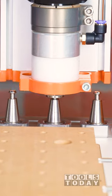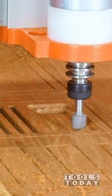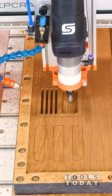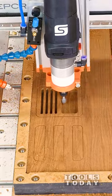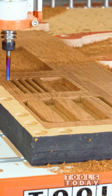We'll use the automatic tool changer to pick up the bull bit. This bit is going to go through here and cut in several passes, using an offset cut to remove the majority of the waste, then using a raster cut to go with the grain with a small step over to give a glass-like finish. I'll show you that here in just a second.